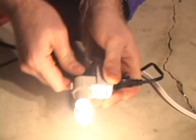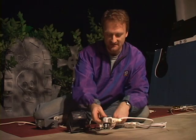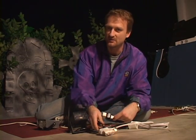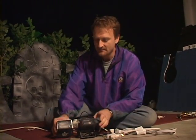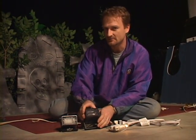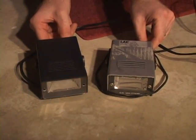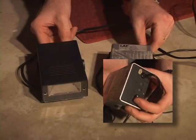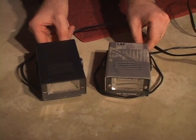So here we have the night light on the end of the extension cord and two strobe lights plugged into this extension cord. This extension cord is plugged into our flasher circuit, which is plugged into the wall or another extension cord. We're using two strobe lights because then you have a sort of random flash between each of them. It simulates lightning more closely. The best thing is to not have the strobe light turned up all the way — it's better to have it at a very slow rate, and each one slightly different, so when it flashes they play off each other randomly. And that's pretty much how you make homemade lightning.